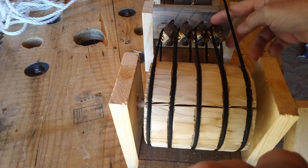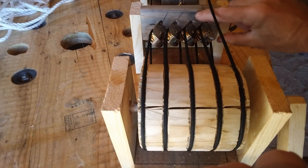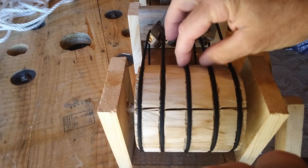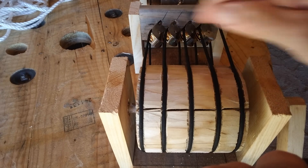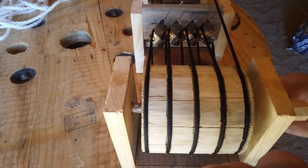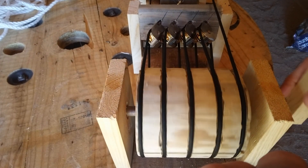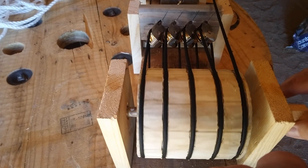The pulleys have to have the right angle and the pulley has to be wide enough so they feed right back to the same width of the grooves I have cut into this cylinder. That way there's no jumping off the grooves and it just works smoothly.